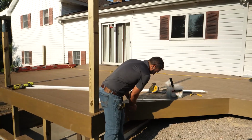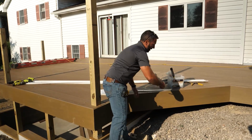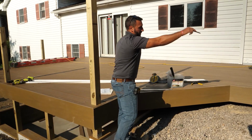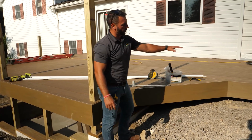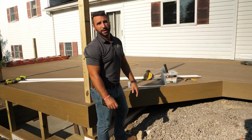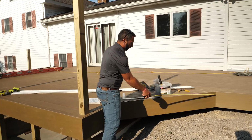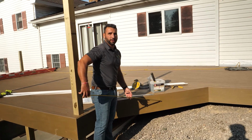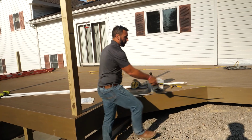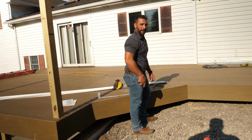So we're gonna put a boulder not to exceed this spot, right? Okay. In here. And then we're gonna do Black Hills machine cut steps the whole way around. So it'll be 12 inches. So we'll have a 6-inch step down on our Black Hills step and a 6-inch step down to our patio. So just one 4-footer from here across. Step. Step. Yeah. And then we'll cut it. You know, they'll come around, so we'll cut that angle. Okay. Right there. Yep. And mesh them together.